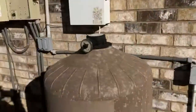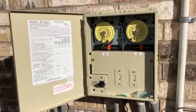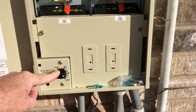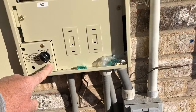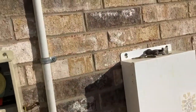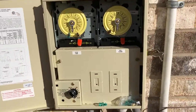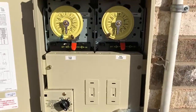We are well below freezing and the freeze protection is not coming on. A couple of reasons come to mind immediately: the thermostat is not set to a high enough temperature. It should come on when it's 33 degrees or lower, but often it won't. The biggest reason is it's attached to the house — this happens to be the sunny side — so it warms up much quicker. If you feel the inside of the timer it's actually quite warm, so there's enough heat generated inside the time clock itself to prevent it from coming on.